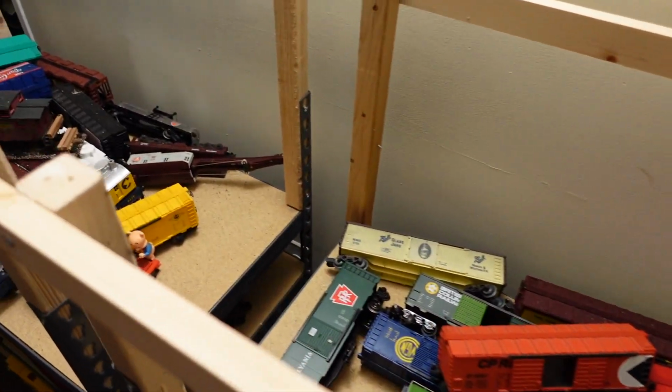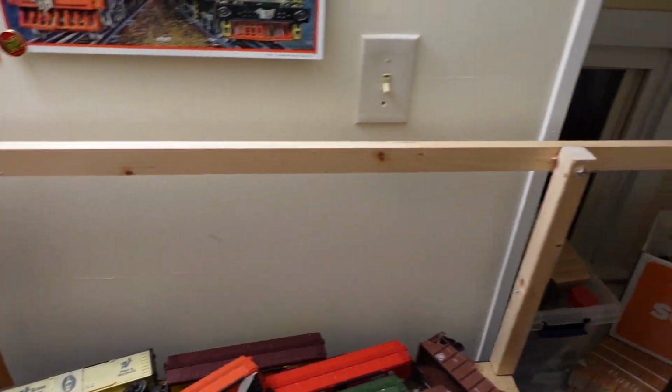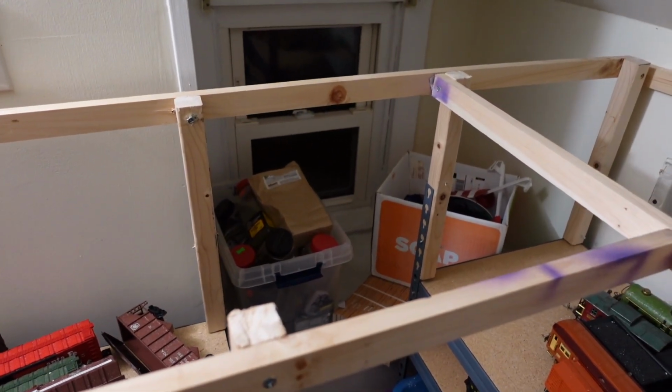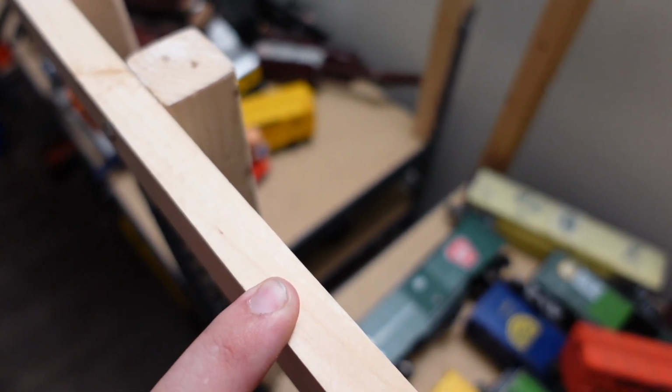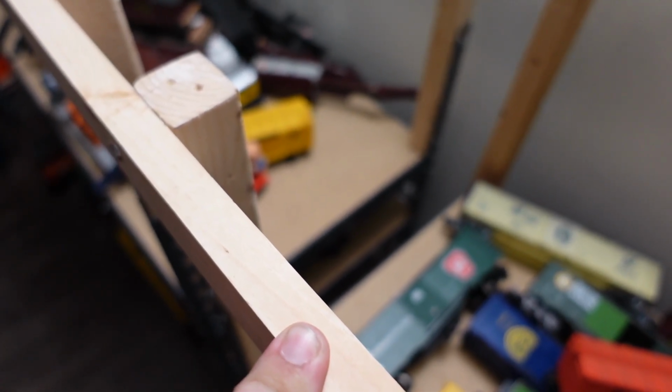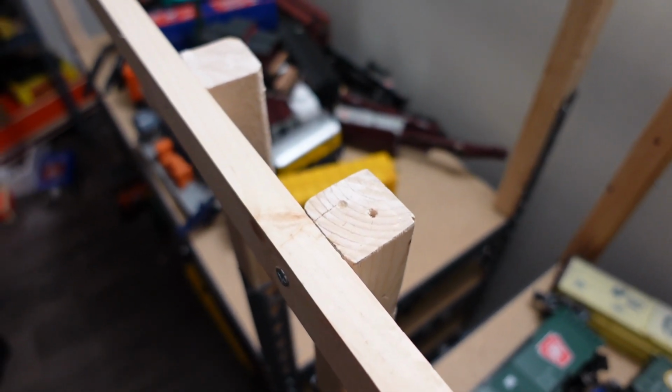And then if we move on, same with here. Now these boxes that I made, these should be extremely strong with the plywood and then the foam put on top. And this wood here, this is a pine. It is nice and soft, so you can actually use like 1-inch screws to put down the plywood, and it stays really nicely. So I tried that out, experimented, it worked.